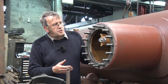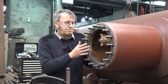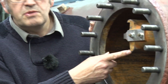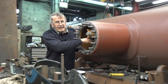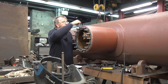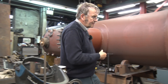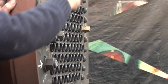This is the dome of the loco. The dome lid with the modern safety valve we were looking at earlier will sit on top here. In here we've got the loco's regulator valve, which is an original part that we've reused because it was in quite good condition. This is where the steam is collected in the dome, and as the regulator valve is operated the steam is then allowed into the pipe, down and out to the front of the loco within the smokebox, and that comes out and is passed down to the cylinders.